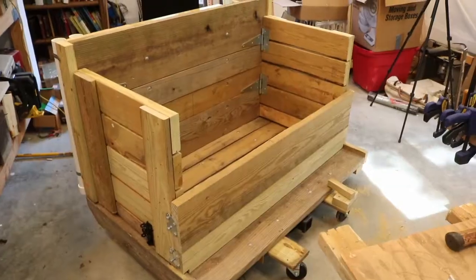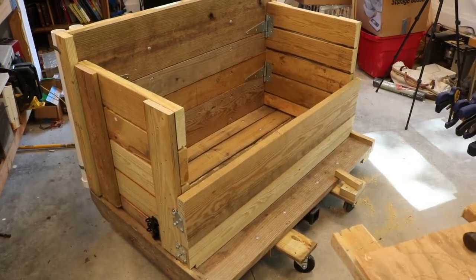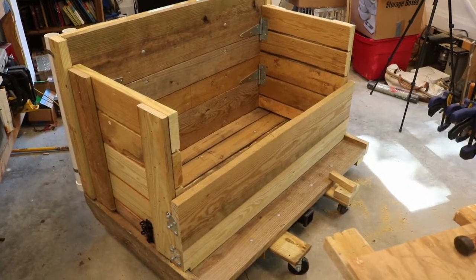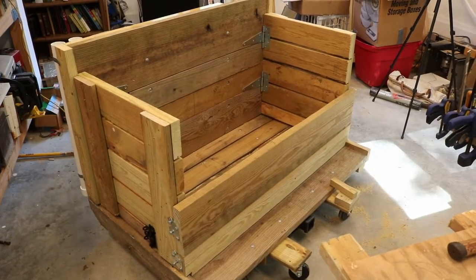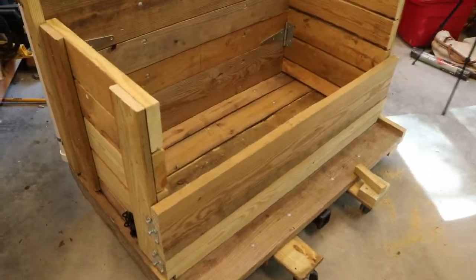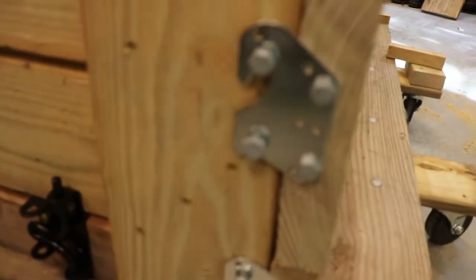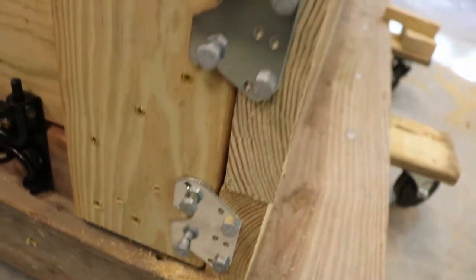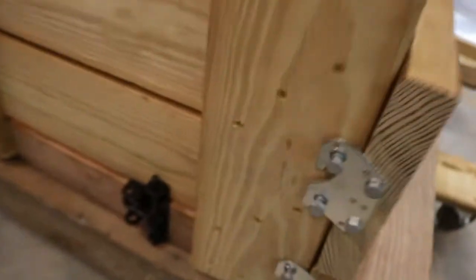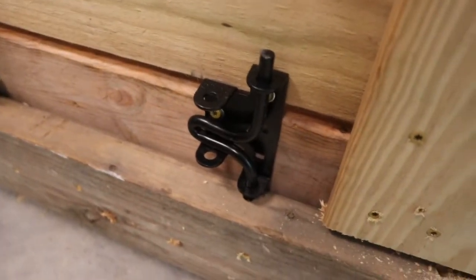Okay, YouTube, I think I'm officially done. There's only one thing left to do, and that's the 2x4 uprights. They're 66 inches each with a hook on them, so I can put the weed whacker on it. But I went ahead and put on the gates with the bed hooks. I got a 2x8 and a 2x6 on the bottom. That's for the front gate. I moved the gate latches from there because it wasn't closing properly, so I moved them over here, so now it closes great.